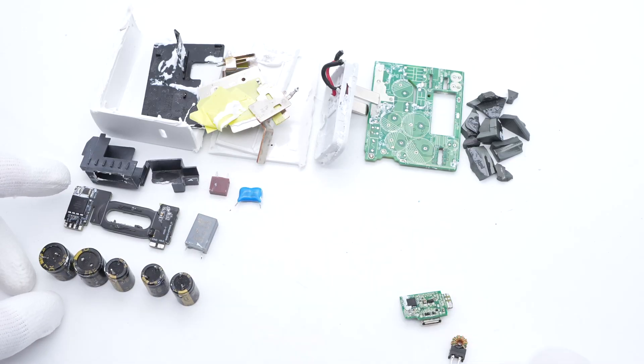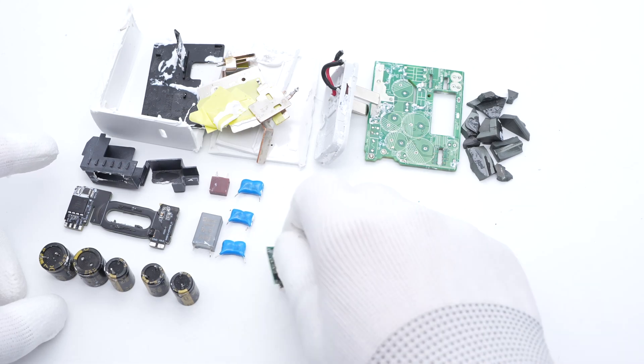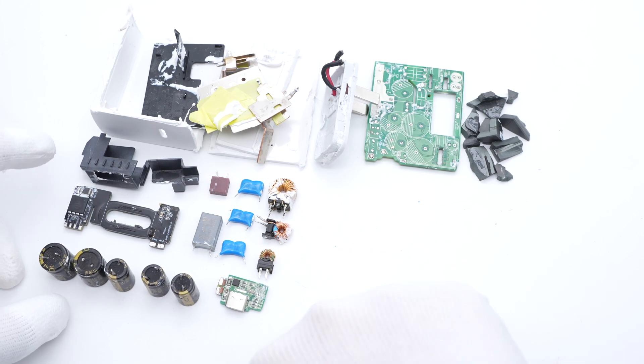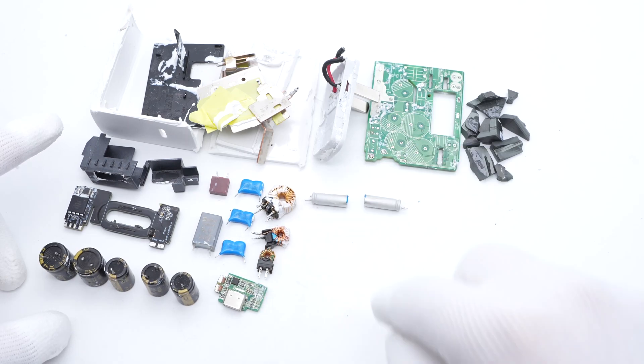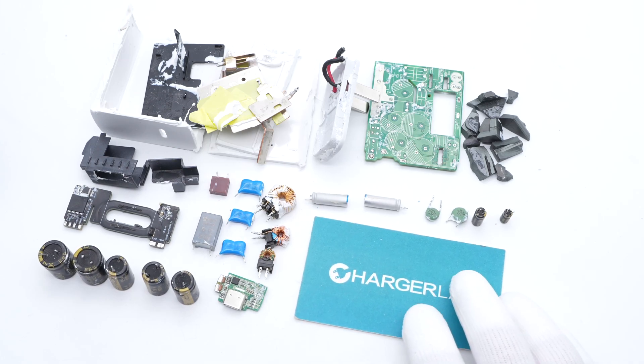That's all the components of this 120W flash charge charger from Vivo. It can not only support Vivo's proprietary protocol, but also support up to 65W PD protocol. After taking it apart, we found it adopts a planar transformer and GaNFET inside, which are the critical components to make it compact. The GaNFET is from InnoScience — a customized model for this charger with high quality. OK, that's all for today's video. Please drop a like, leave your comments, and subscribe to us. I'll catch you guys in the next video. Bye.